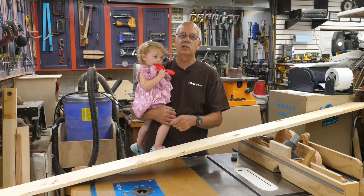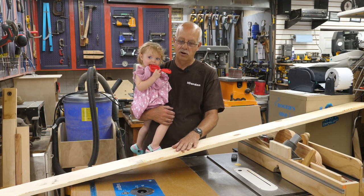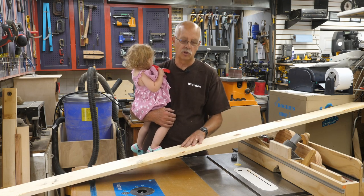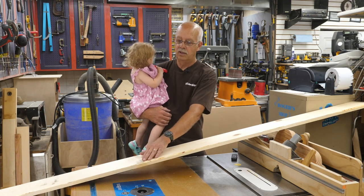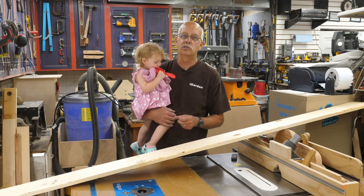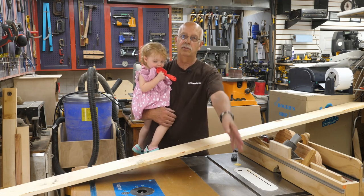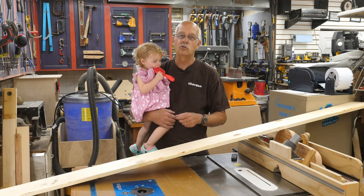What I'm going to talk about next is the lumber you're going to need for building the candy boards. Right here is a 1x8. A lot of lumber yards have what they call a bargain bin or bargain shelf, and that's where this stuff comes from. As you can see, it's pretty rough, and there's some defects in it. Of course, there's some knots. But because of the way the pieces are cut and laid out, I'll be cutting around all these defects, and like on the bad edges here, that'll be waste material. So you can use just about all the board.